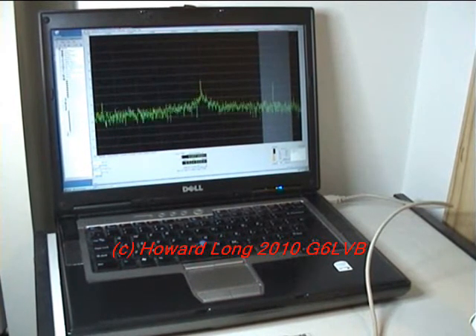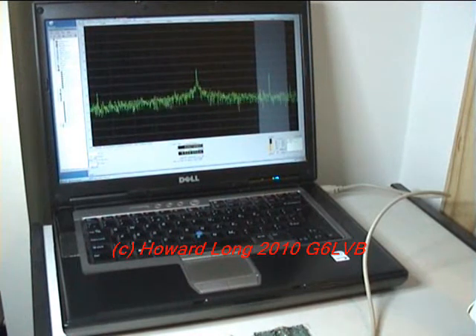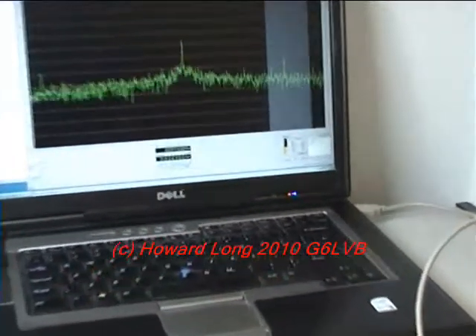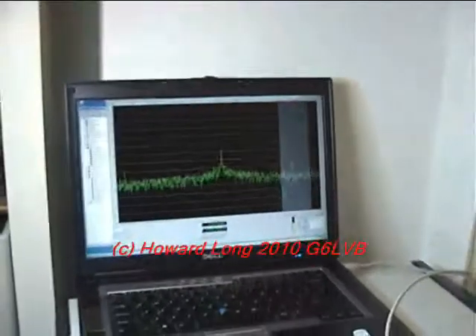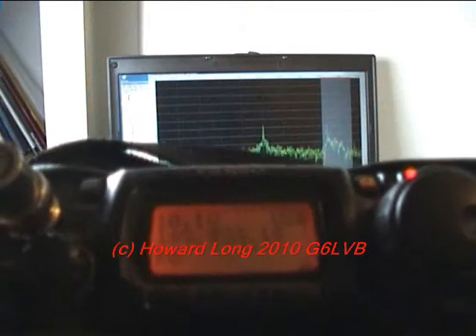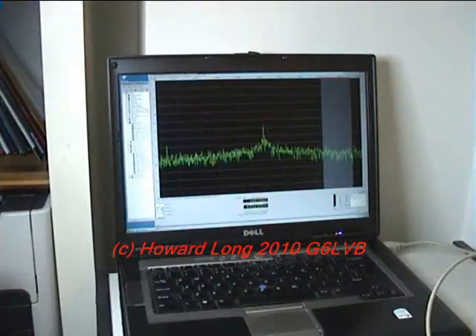You may be able to hear a little bit of clicking — I've got a small bug in my sound card firmware on the PIC32 and it's not quite working 100% yet, probably some buffer-related issue. But I'm going to drop it down by another 10 dB to show you that it is fairly sensitive — I've got it to minus 117 dBm. You can still see the signal there; it's probably around 15 dB above the noise, and it actually demodulates the RF. I've got my trusty FT817, and you can hear the USB signal being demodulated by our FunCube Dongle.